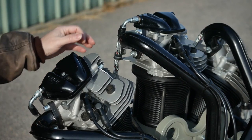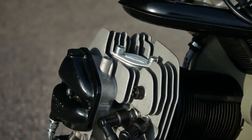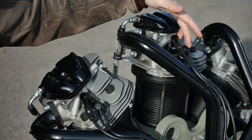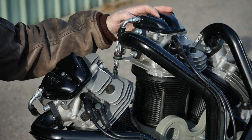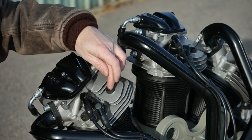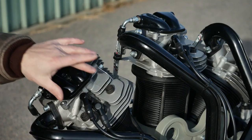Here's a view of the top of the engine. Here's the cylinder head — cylinders that Werner makes themselves. They're aluminum with a steel liner. This is a purchased head, an OEM part. They make their own valve covers. Here's the dual spark plug setup — they drill it for a second spark plug. Here's the oil line coming up and feeding oil to the top cylinders into the valve cover. These are Volkswagen-style head bolts with a rib spline type feature — there are four of them, two accessible inside the valve cover and two exposed.